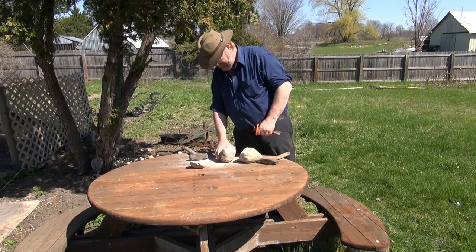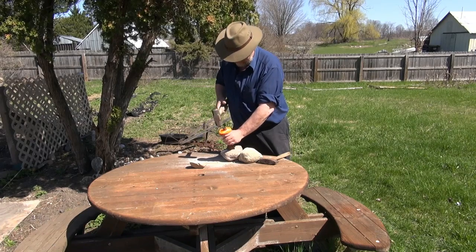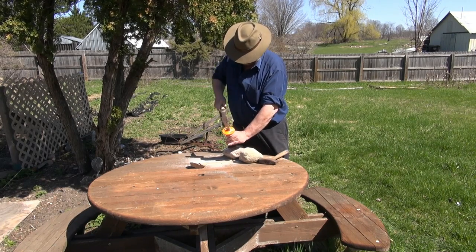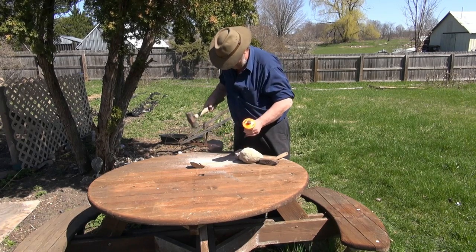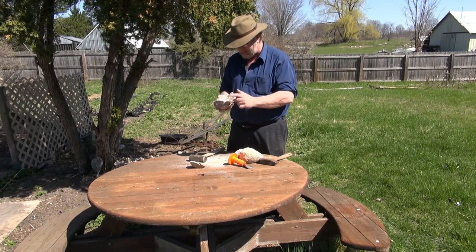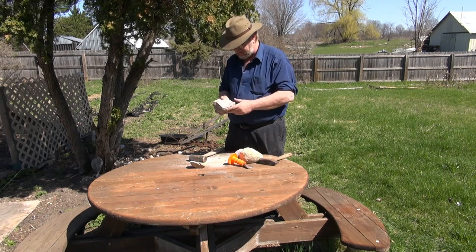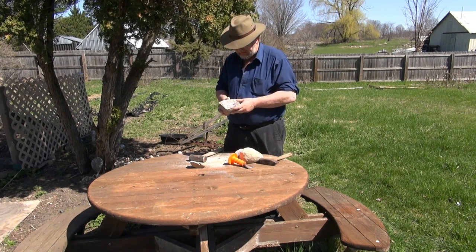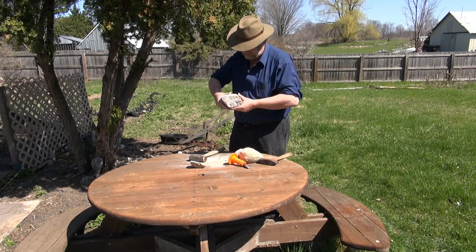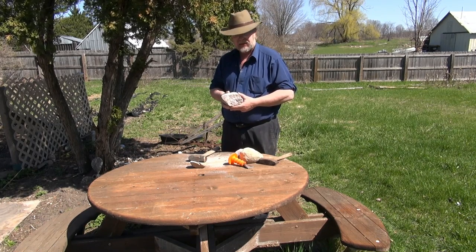A little piece of it has cleaved off along its natural plane — so maybe that means we're getting close. There goes our cut stone. And while I didn't get a perfectly even cut, I could go back and clean this up. I just wanted to show you that it's not a hugely involved process, although each stone takes some time, and collectively it would take a lot of time. A professional stone cutter would obviously finish cutting this to a nice even plane, and then these would be laid up in the wall facing out, so you'd have a nice cut face on your foundation walls.